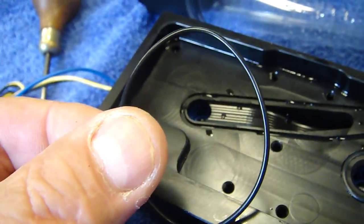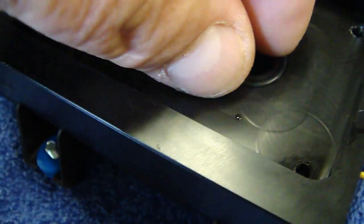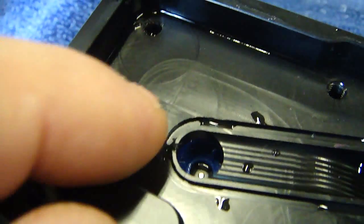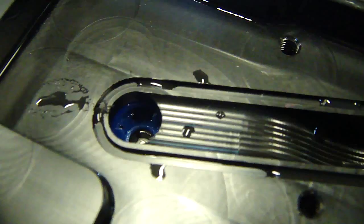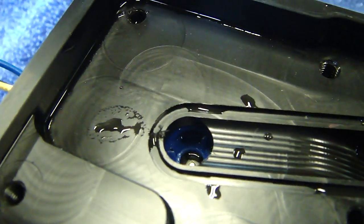The o-ring itself is perfect — there's nothing wrong with the o-ring. Nothing wrong with this o-ring either — it's perfect too. It's hard to get these out once they're in there. But that little strand of acetal is acting just like a wick, and that's why this whole channel is not sealing.